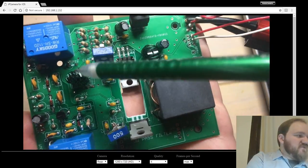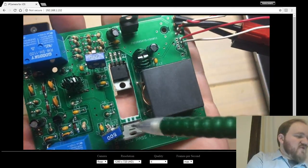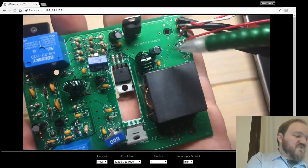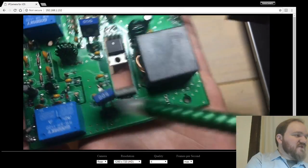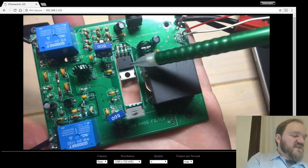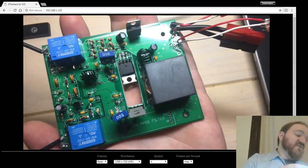The signal then goes through this balun, essentially, to the two power transistors here, which are IRF510s. These are the bias pots for adjusting the bias on both of those signal pins. We go through this choke, which provides power. We go through our output transformer, through our low-pass filter, out the relay, and out to the output. So with 13 volts or so on the drains of these two FETs, we get about 15 watts out. With 26, 27 volts, we get about 50 watts out.